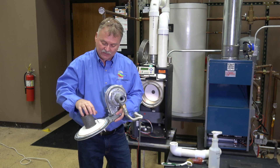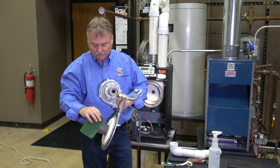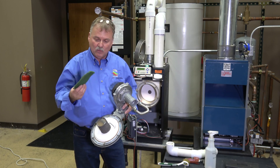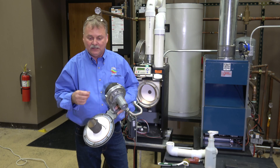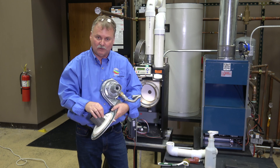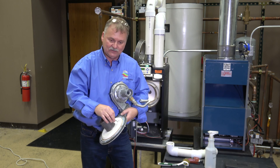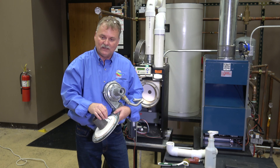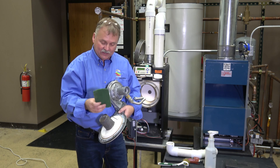I want to then look at my flame rectification probe and my spark igniter — I want to clean them. The easiest way is to take the two screws, pull them out, and then clean them. The biggest thing: you want to use a Scotch-Brite pad. You don't want to use sandpaper, sand cloth, or steel wool — any of those items normally leaves a bit of residue on the flame rectification probe. Once that starts oxidizing and getting heated up, it has a tendency of covering it up again. So you clean it, everything was great, and two weeks later you've got a call that you're not getting good rectification. You come back and it looks all rusty — that was the residue left from the sand cloth or steel wool. So go buy some Scotch-Brite pads — they're cheap, inexpensive, and they work great.